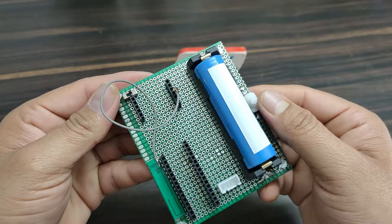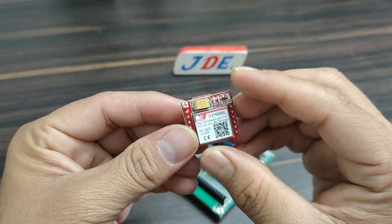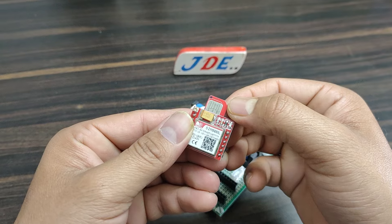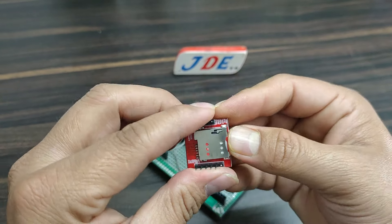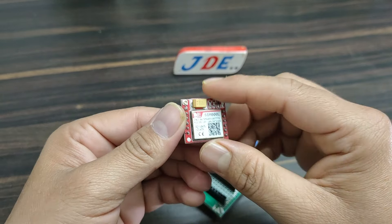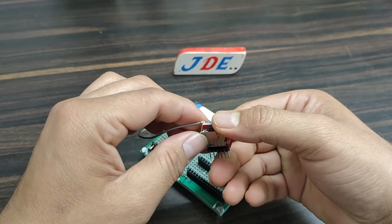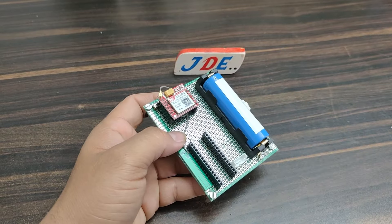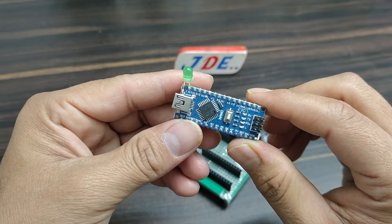This is the power on/off switch. Now I connect the SIM800L GSM module. You can attach your 4G or 3G SIM card, but it does not support Jio in India. You attach the SIM card like shown here. Now I attach the antenna and connect the female header.